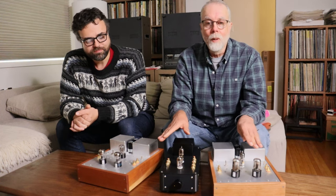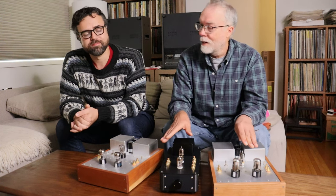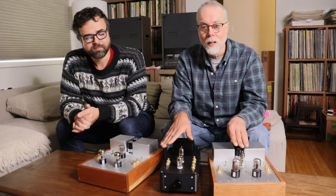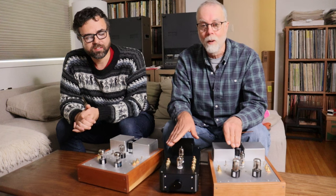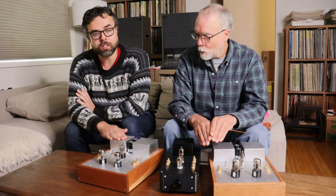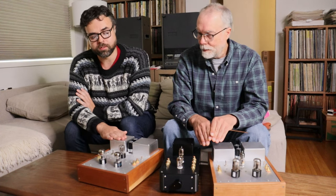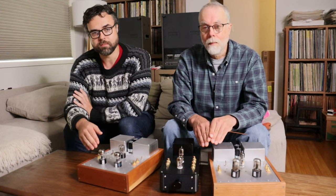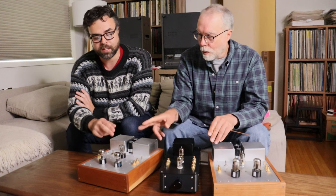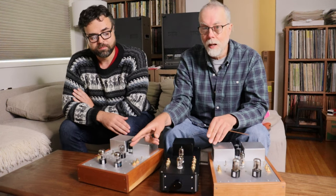You just can't do that. Even though we do a fair amount of experimentation on our benches, we absolutely never do that. We will have a data sheet, check the maximums of the tubes we want to try, do a load line and make sure it looks reasonable. On the note of substituting the 6N6P into this unit, you can only do it with six-volt tubes because the filaments are shared. You have to use 6SL7s in the front stage or rebased 7F7s.